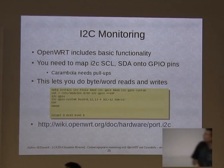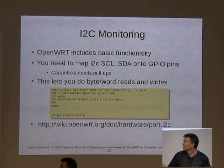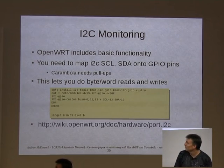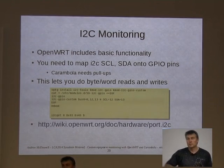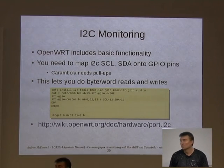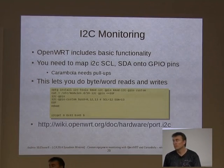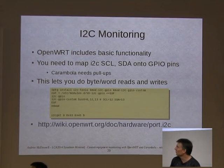If you want to monitor I2C, all you need to do is pick a couple of pins on the Carambola board. If you're not familiar with I2C, you can find it on Wikipedia, and there's also a bunch of stuff on the OpenWRT wiki. I2C is a bus, so you can connect it to equipment you want to read status out of, which is what we did. The default I2C tool that comes with the Carambola OpenWRT is good for doing bytes. We actually had to write a custom one in C because we needed to do extended messages, but most of the time you won't need to do that.